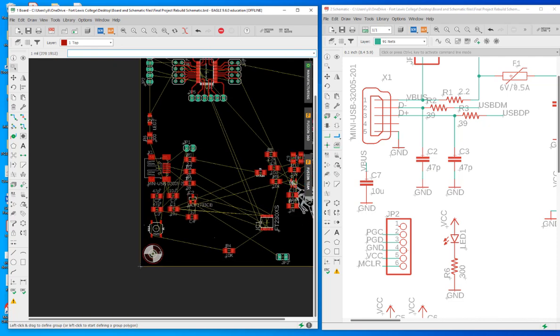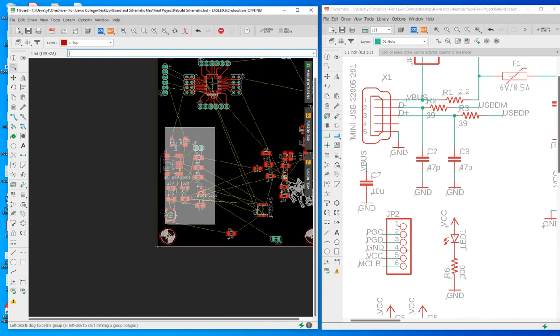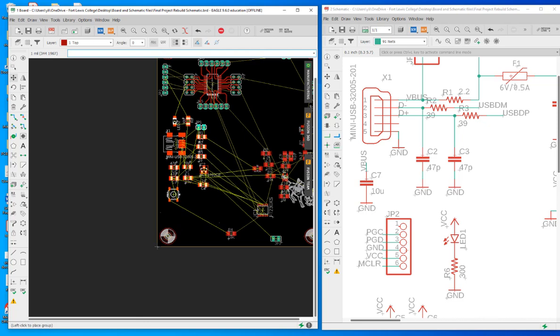So I think we can directly just drag it to somewhere else. So R6 and LED1, these are power indicators. So they should be placed close to the power, because that's where that comes from. And we could either, I mean, place it here is fine. We have space here, so I think it's okay. Okay, so this area is done. We just place it here.